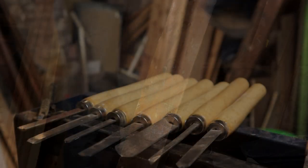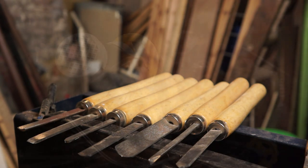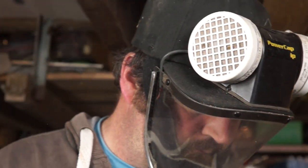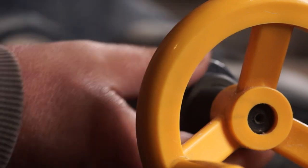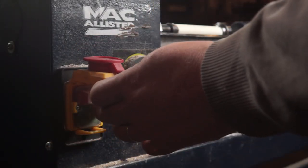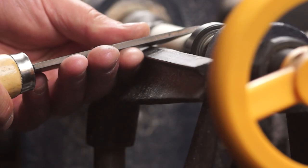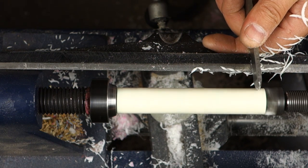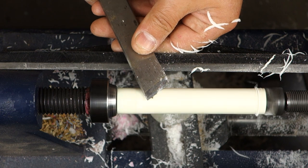The lathe is one of those machines that stands a little apart — I've never got over excited about using the chop saw, but I've happily spent evenings turning things on the lathe until the small hours. For this project, rather than work from a drawing, I'm going to work from memory and follow my eye to create a very basic shape. Tools wise I'm going to stick with the skew chisel, and the first job is to true up the piece. I'm also marking a collar to stop myself from running the chisel up into the drive centre and blunting it.